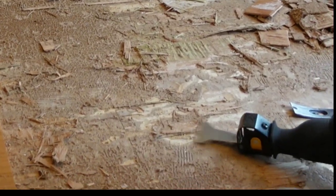If it's a small hole or something like that, it'll float and should be fine. But if you've got a huge gouge - like 10 inches or bigger - it might be best to just go ahead and cut that section of floor out and replace it with new subfloor. I know that stinks, but it's better than having it fail later on.